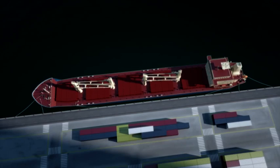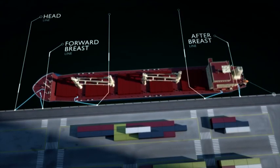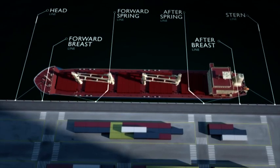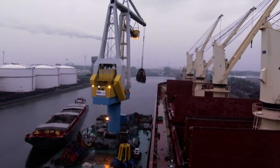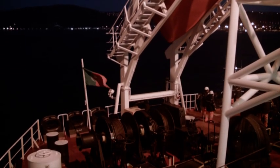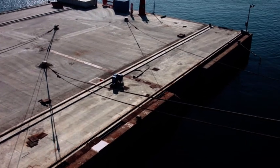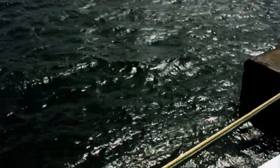It's important to have equal tension on deployed mooring lines, so that an individual line is not overloaded. If a headline, a breast line, a spring line, or a stern line is overloaded, it is possible that the line will part, endangering personnel, causing damage to the ship and adding stress to the remaining lines. Tension on lines can change for a number of reasons: loading and discharging can alter the vessel's draft; tidal effects can raise and lower a vessel relative to the jetty; and the wind can also affect the line's tension. Likewise, a previously secured line can slacken if there is slippage on a mooring bit or brake rendering on a winch. A line parting can alter the tension of those remaining. Ship-to-ship transfer operations can also affect line tension, as can waves causing a vessel to roll alongside.